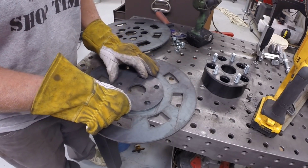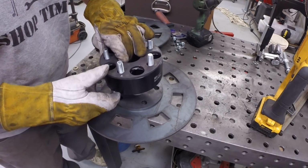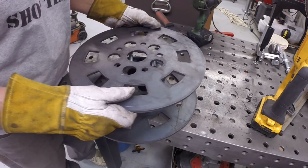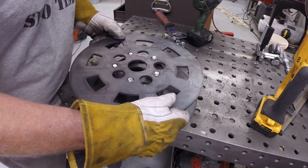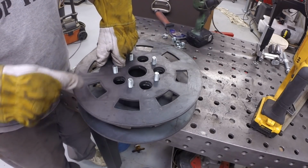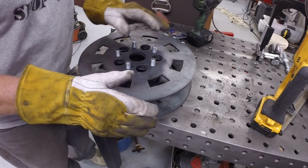how it's supposed to go together: these two on the studs, this goes on, lines up with those, spacer there, and then this. And these large holes let me reach the studs to fasten it. And the spacers are needed to get the proper width here for the chain.